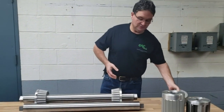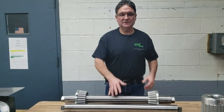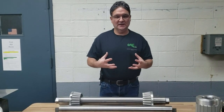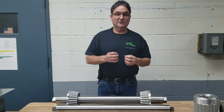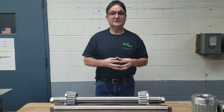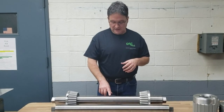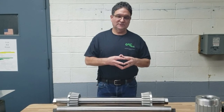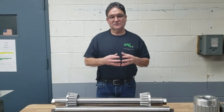One of the things that people don't realize with the hollow steel center shaft is that beams get most of their strength from the outside diameter. So when you make them hollow you lose very little beam strength but you gain a lot of weight savings — that's the reason why we make them hollow. This shaft with the roll mounted on these core cones at maximum deflection will only deflect about 20 thousandths of an inch maximum, so it's very strong and very lightweight.